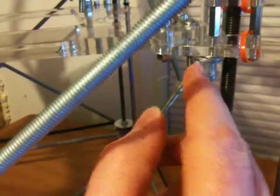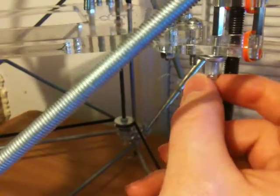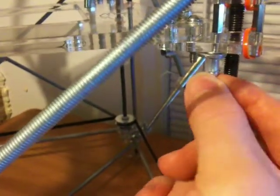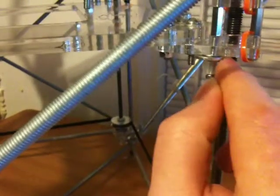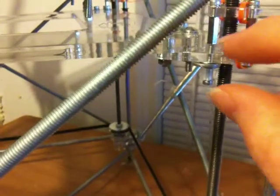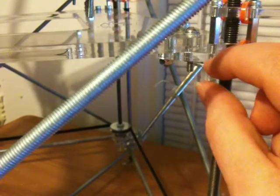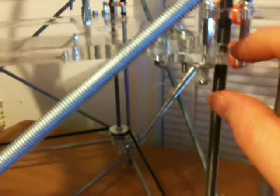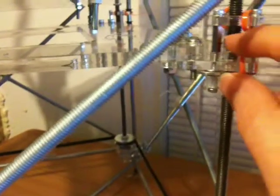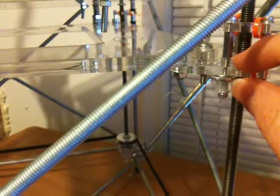This is a large washer with a little tiny washer, and then a piece of tubing, a little tiny washer to hold the tubing, and then the hex bolt. What that does is it makes it so that the little nut is held on top by the large piece of plastic, and it's held on the bottom in place by the washer. This works really good — prevents my table from sliding out — and having one nut instead of two reduces the friction by half, makes it a lot easier for the motor to spin.